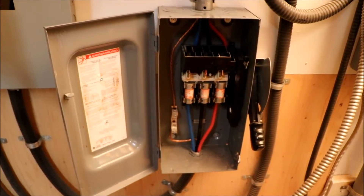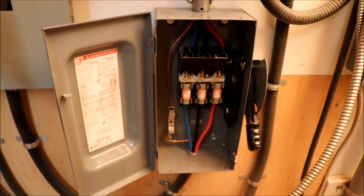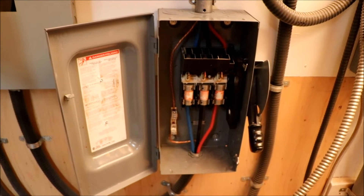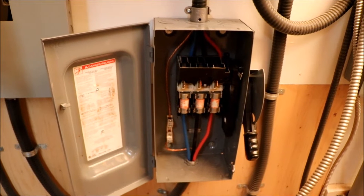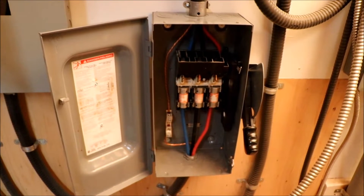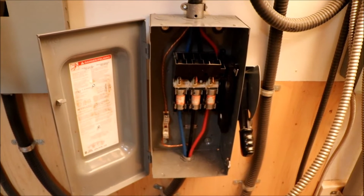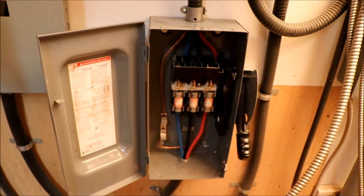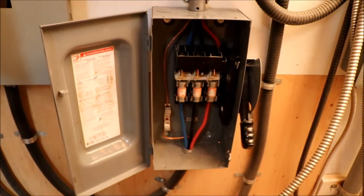A quick look inside the breaker panel: the three lines come in on top and you really have to crank those down to make sure the lugs are tight. It goes through the breakers, and that allows the power to go to the three-phase panel. I would suggest that if you're buying one fuse, you may as well buy six or a pack of them, because it's a pain if you have to run into town to grab one if you lose power on one of those breakers.